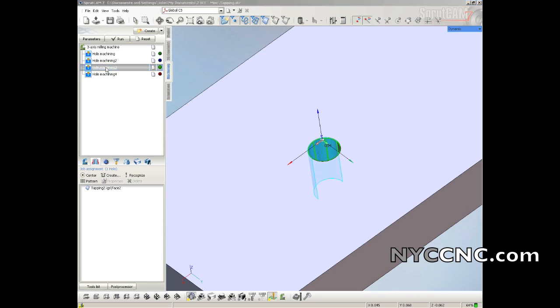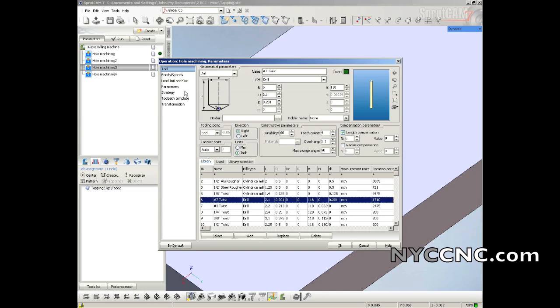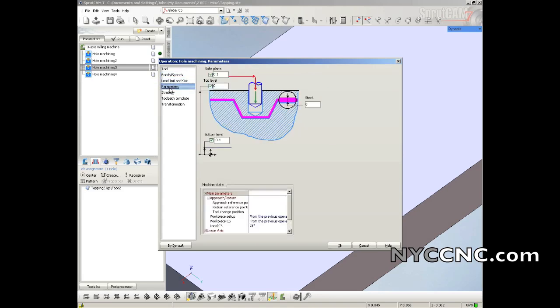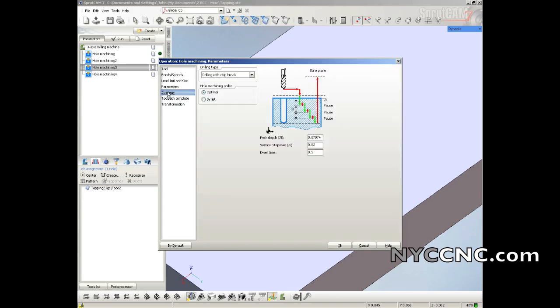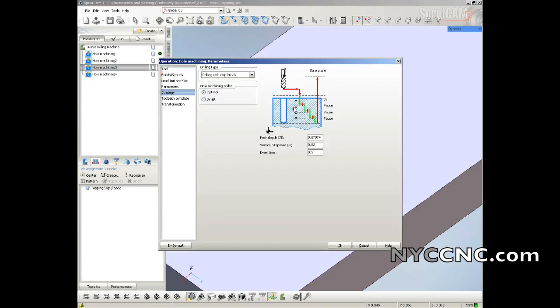The next will be my number 7 twist drill. So I've got a number 7 drill in the tool table here. Ran the feeds and speeds, 3800, 17.1, 0.10, -4. Actually, I realize I need to take that a little deeper. No, I'm going on through the hole here. Definitely want to experiment on through holes. And actually, you know what? Forgot to show you. For the 1/8 inch, I want to run a deep drilling cycle that will cause it to retract fully every 70 thousandths. On this one, I'm going to do a chip break, which doesn't retract all the way, it just backs up a hair to break the chip.